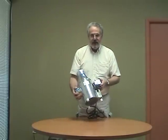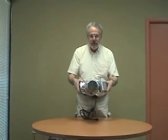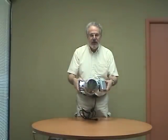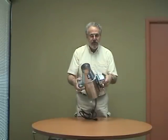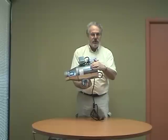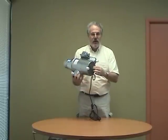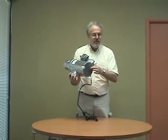Now the way the fan is set up — and this is by design, as you can see here — the motor is completely out of the air stream. You see an axial fan blade that actually does the air movement, and then a steel wall with a gasket to protect the motor. The motor sits back here. There are 48 air holes just to ventilate the motor and a grill on the bottom to allow for the airflow to move. This is just to cool the motor.